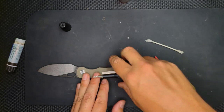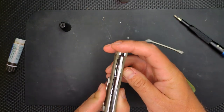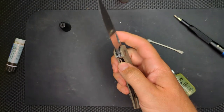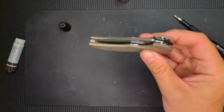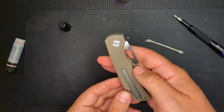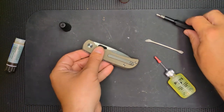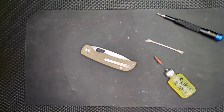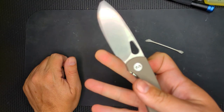The backs are now nice and tight, and the pivot is probably a little too tight. It feels a little tight — perfectly centered. I'm flicking it a few times; the oil is now working its way around. Let's see the action — let's see if it falls. Yeah, it's falling nicely. It might just be a hair too tight, but I'm going to leave it a hair too tight because this is going to work in. It's going to wear in a little bit more and will naturally loosen up the more it's used. This Loctite will need 24 hours to dry, so I'm not going to play with it tonight — I'm just going to let the Loctite do its magic.